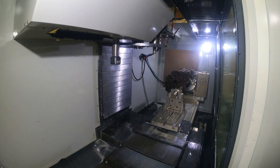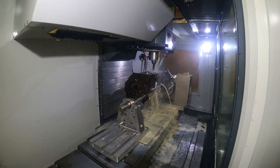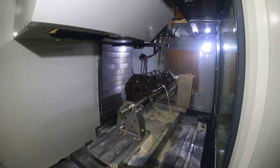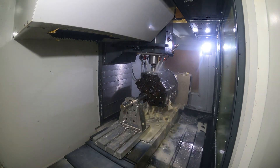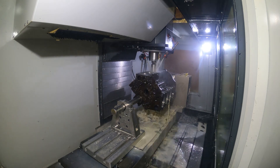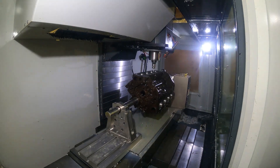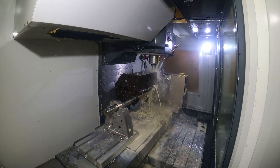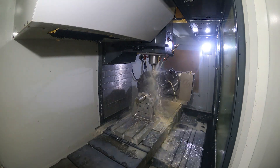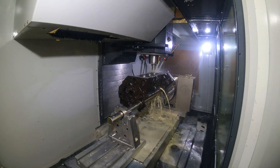So reset the finished boring heads and do this again. Now after it's done it's going to probe again and it stores that information of what the actual bore size was when we finished boring. We checked the first bore and the last bore that we machined — that's just to make sure we didn't chip a cutter or get some kind of heat that influenced our bore size or anything funny happened. We maintained consistency from the beginning to the end.